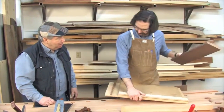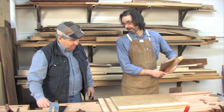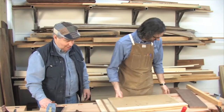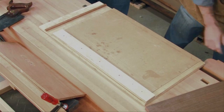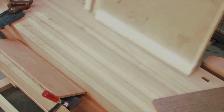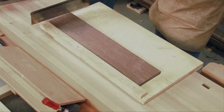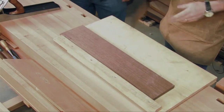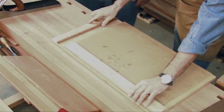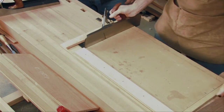I've got two other redneck jigs for that. This one's a little fancier — it's MDF and plywood. Here is my end grain shooting board, and it's also a sawing bench hook. I'll take a piece of wood, saw it off to the right length on the bench hook side, then quickly flip it over and plane the end with a plane.